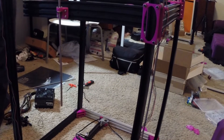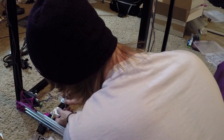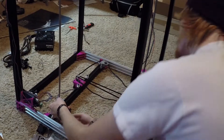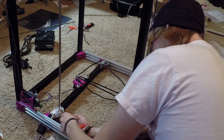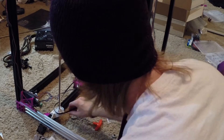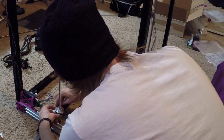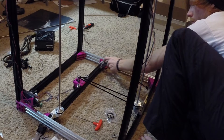You can see how long these Z-axis lead screws are — they go all the way down. You can see how it sits in the bracket on the Z-bar, and now you can finally see how the two belts will be oriented on the center Z-bar and across to the frame. One note: I ended up moving the two tensioning pulleys on the Z-bar much further away from center because the belt itself didn't need very much tensioning at all. The belt size I chose was almost exactly perfect with the two pulleys and the center motor.